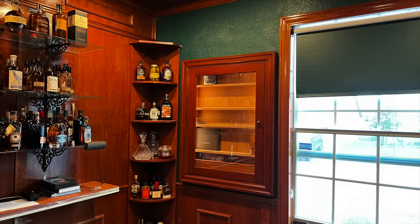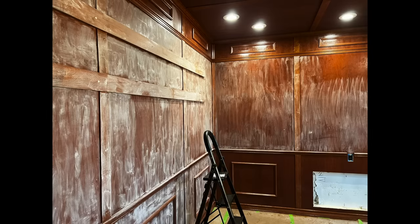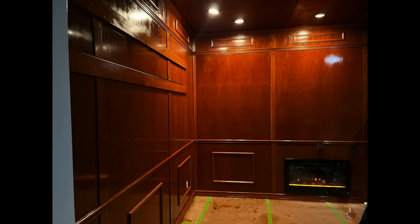Once all of the plywood panels and molding pieces were installed, it was time to sand and varnish. I chose a marine varnish after sampling 1 coat of polyurethane. The varnish produces a darker, shinier surface. Plan on 4 coats of varnish, unless you're very experienced, and then you maybe can get by with less.